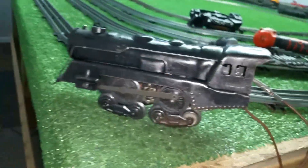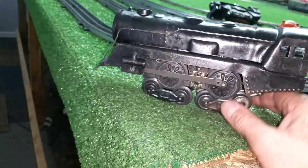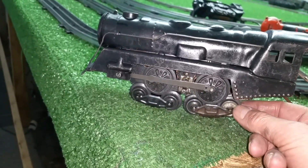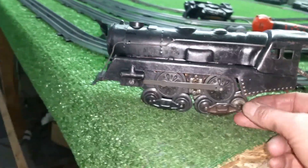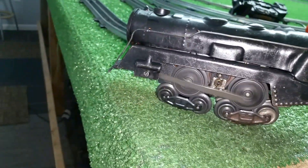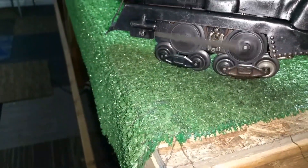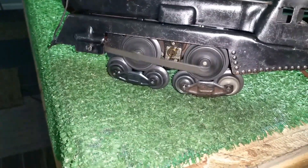Screw them down to a piece of wood, and you have a test stand. It works. This is really crude, of course, but it does work — that's the neat thing about it. Keeping it all lined up, I've got this one screwed to the table; this one's just sitting here. It won't take much to get this running. It's pretty straightforward, just a matter of getting everything in line. And you have a test stand that you can test locomotives without having to take them to the rail, and you can run them under a load — that's the neat thing about this.